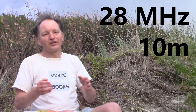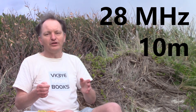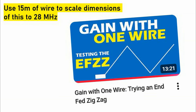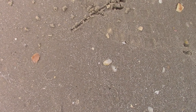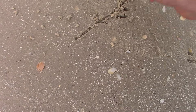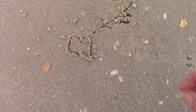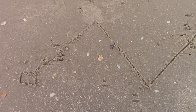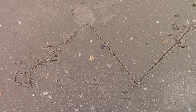If you want something that's a low angle radiator on 28 megahertz, have a look at my videos on zigzag antennas. In this case, you can have 5 metres going up, another 5 metres going down, and another 5 metres going up. That will give you a low angle of radiation on 28 megahertz, though unless you've got some really tall poles the height isn't very good. At least it gives you vertical polarization at a low angle of radiation, so it's something worth trying on 28 megahertz.